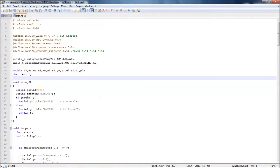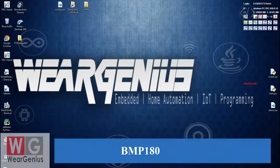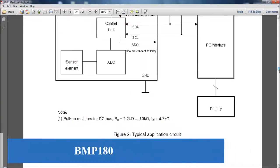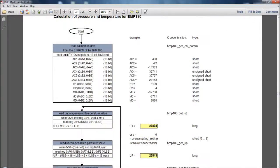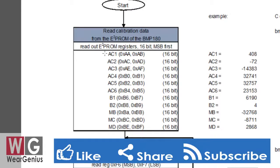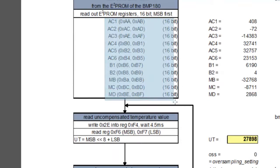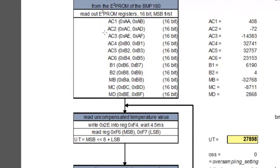This is the code that we are going to use to interact with the BMP180 module. But before going to the code, let's check out the datasheet of the BMP180. Going into the I2C communication, which is our matter of interest, you can see this is the flowchart given on the datasheet. Before calculating temperature and pressure, we need to read out some ROM locations which hold some compensation data — that is AC1, AC2, AC3 up to MD.